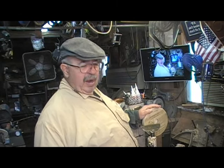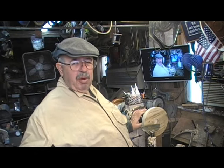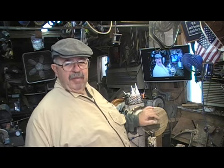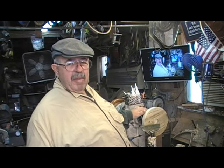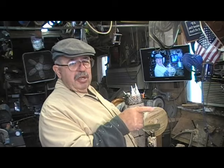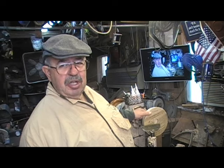I flipped this around. You should take note. It's on the chuck. I just pulled the faceplate right off the other end of it, or unscrewed it off the screw chuck, and I now have it mounted in a chuck, and I use the gizmo to do it. The gizmo is very important. If you're going to invest in a chuck, and you have a revolving center, you need that third part. You need that adapter. They are sold 3/4 10, which is the revolving center, to the thread size that fits into your chuck. Don't buy the wrong thread size.